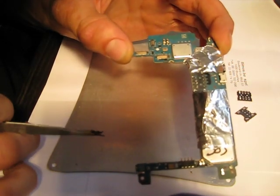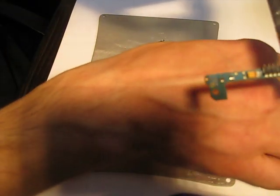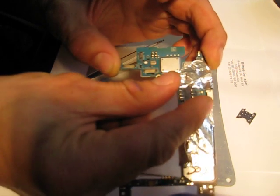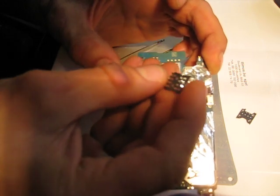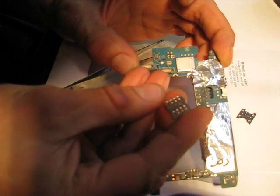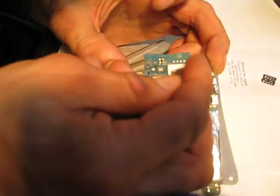When you put it back, you go only with the soldering iron — no heat gun, no nothing. You place this on top of the soldering point, and through this you have enough space to solder each and every pin in place, and then you clip the new cap on.